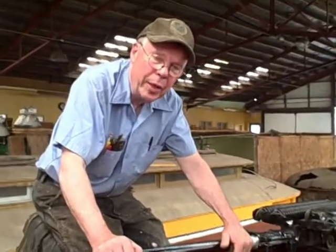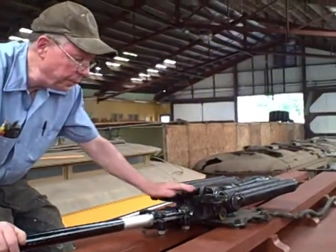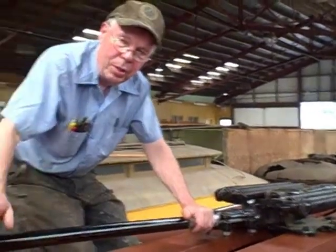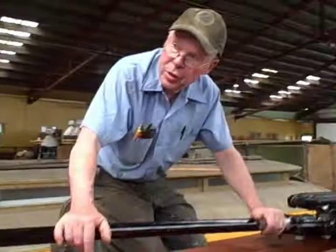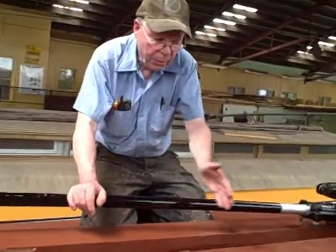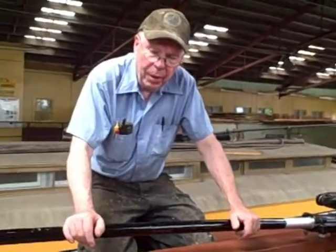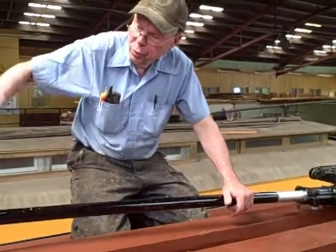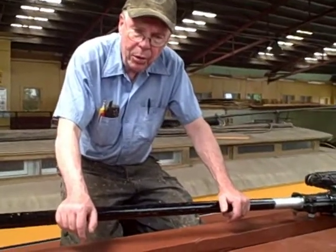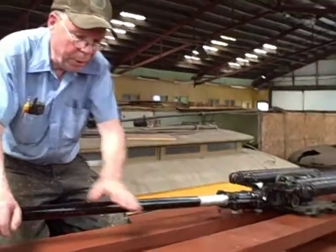This is the final work we're doing on the roof of ASL 100. This is the US-10 trolley base, which exerts upward tension on the trolley pole — measured at 25 pounds when it's up against the wire. This locomotive had two trolley bases, one on each end, because they had a problem with having to swing a pole all the way around, possibly between buildings. We went back to the way it spent all but one year of its life — with two trolley bases.